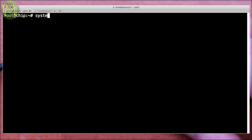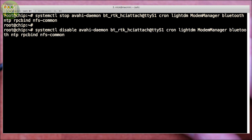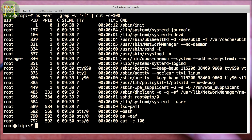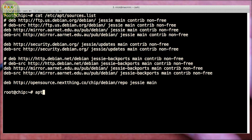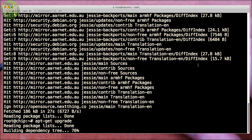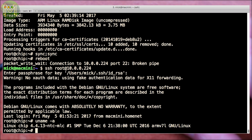So I updated the PMIC, and stopped as many redundant processes as possible. I also disabled them, just so they wouldn't start back up again when rebooted. I was left with just the basic processes, and enough RAM to spare. Updating the source packages and upgrading then happened without issue. Since there were kernel updates, a reboot was in order. Now that I'm running 4.4.13, time to get on to some testing.